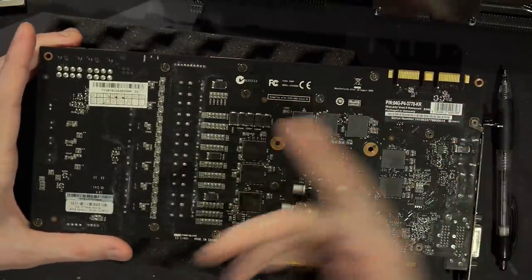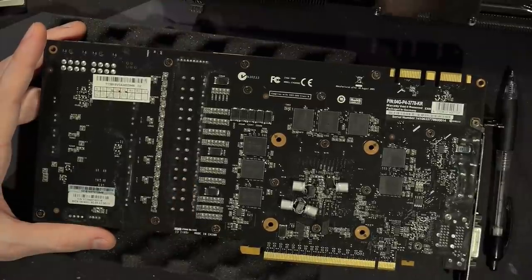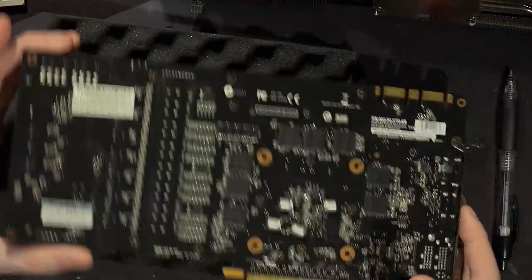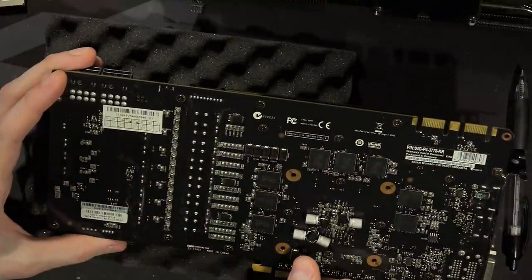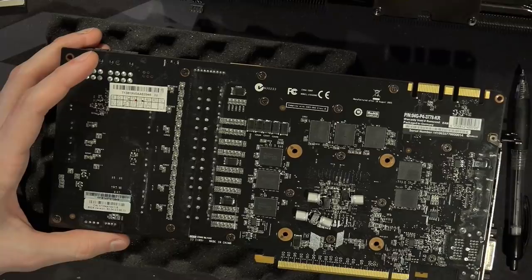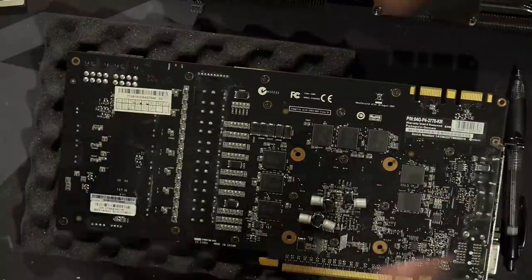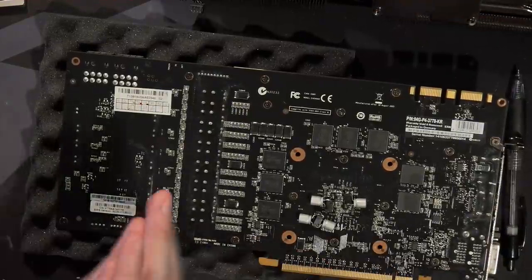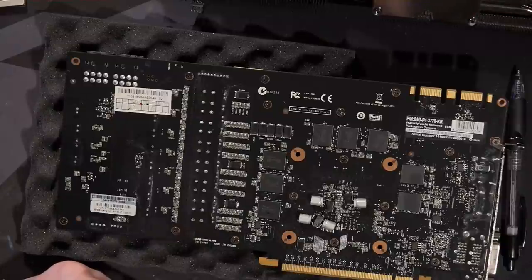There might also be some differences in the actual voltage controller configuration, though they both use the same controllers — this is a CHL8318, the Lightning is a CHL8318. But this is 14-phase whereas that's 8-phase. And there might be inductor differences I didn't account for. I really thought all of these extra multilayer ceramics would translate to better performance, but it doesn't seem like it. From a scientific method standpoint, my scientific method here sucks — I didn't really do a great job of isolating all the variables. I might do a little bit of retesting.